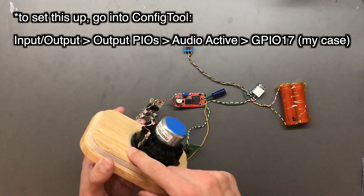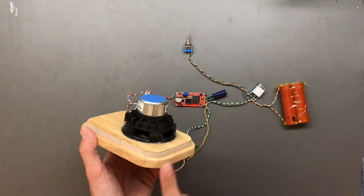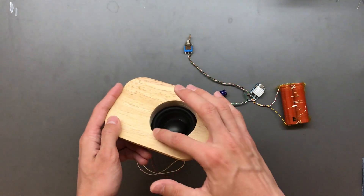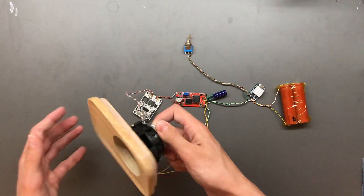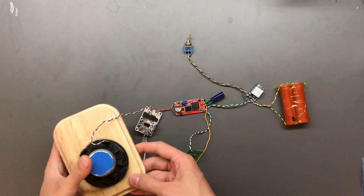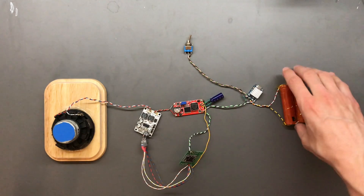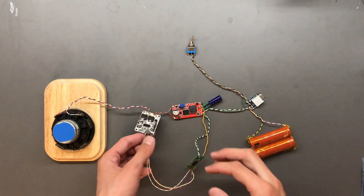This is how the back of the speaker looks. I've used sanitary silicone around the seal — around the lip — to not have anything drip on this side. I haven't used any on the actual lip itself, just around it. It seems to be holding very fine — I'm yanking on it quite vigorously and there's absolutely no budge — so I'm hoping that will hold up. That's pretty much all the hardware.